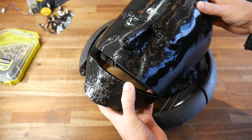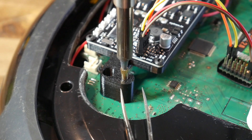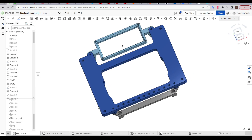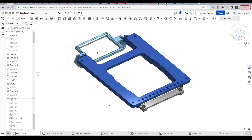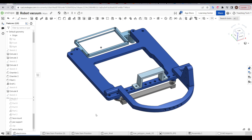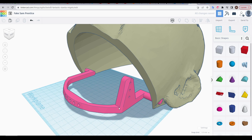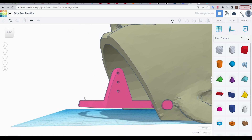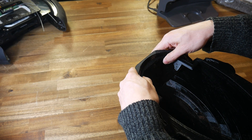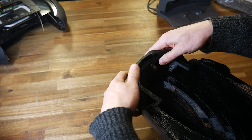After some cleanup, I knew I was onto something truly uncanny. It was time to design mounting parts. I tweaked the design for the two existing brackets, adding extra holes for threaded inserts that I melted into place. I designed a plate wide enough to go behind the face, complete with an adjustable clamp to hold a servo in place to actuate the jaw. I then designed a jaw support, imported it into Tinkercad, and used a boolean cut to match the outer contour exactly to the inside of the jaw piece. Everything fit perfectly on the first attempt, including the jaw having enough clearance to open and shut.